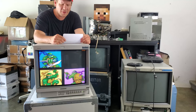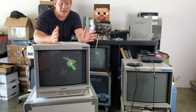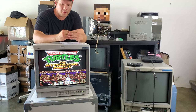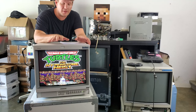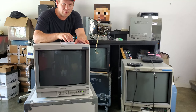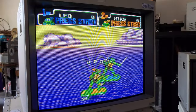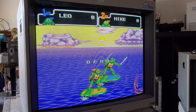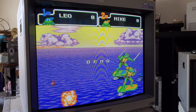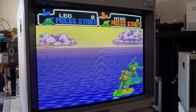Some of the cons: they do pretty much always need some kind of servicing and can develop problems over time due to design faults, usage, and ultimately how they've been stored. This one has been serviced and had a cap kit done. We've replaced capacitors that are problematic — causing things like vertical blanking issues and other geometrical issues on screen — and upgraded those parts, so hopefully that won't be a con anymore for this particular MDU.